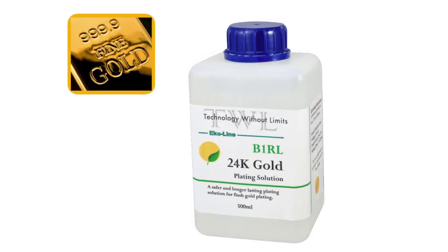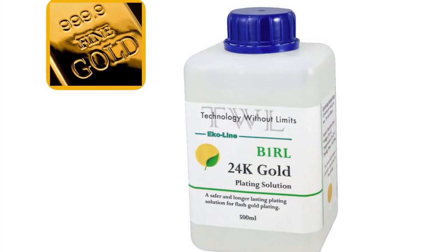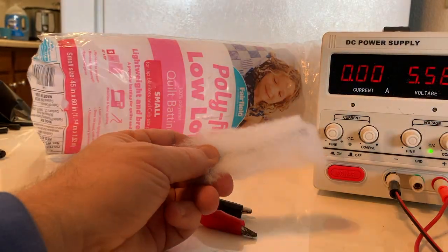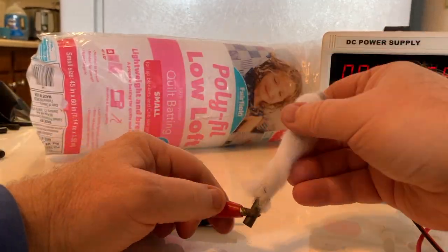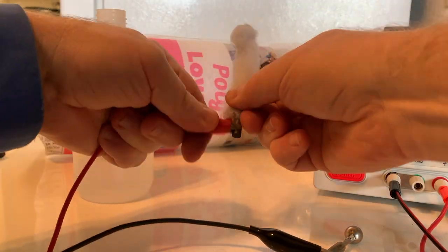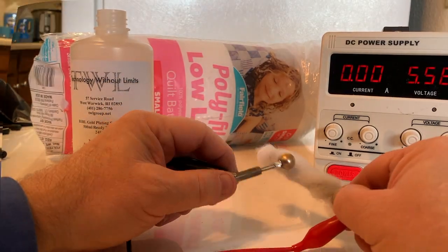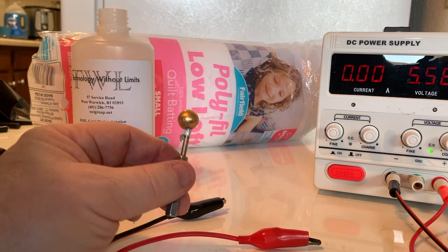You're going to have to purchase the gold plating solution commercially — it's expensive, so you'll want to stretch it over a lot of projects. The simplest way is to secure a carbon electrode, wrap it in a layer of cotton, and connect it to the positive lead of the power supply. Make sure the ball is still attached to the negative lead. Dip the cotton into the bottle to soak up some of the gold solution, and as you gently rub the cotton over the nickel, the surface will gradually appear to turn to gold. I spent about half an hour at this to get a good optically thick coating. Repeat the process with the other ball and your sensors will be ready.